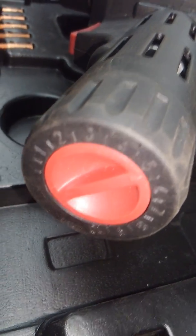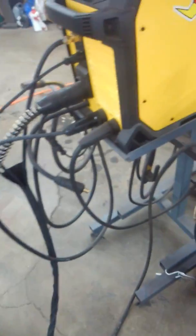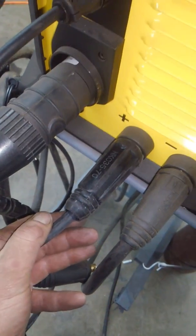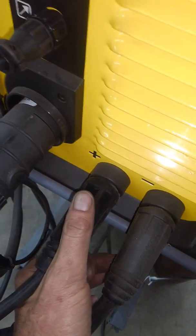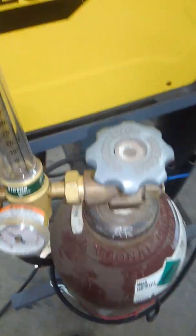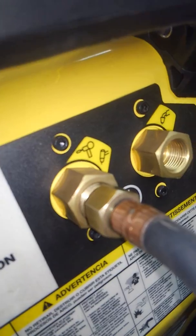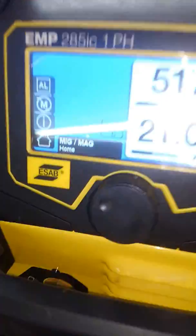Once you get the wire started, you can adjust your wire feed speed on the bottom of the spool gun. I had a couple of issues I didn't understand at first. I went ahead and hooked the spool gun up to the gas on the front of the machine, but this particular spool gun runs off your stick lead. Hook that up — it's reverse polarity for spray transfer — so I hooked into the positive side and hooked my straight argon into the back on the spool gun side.